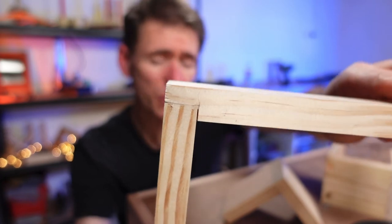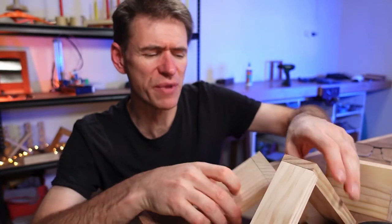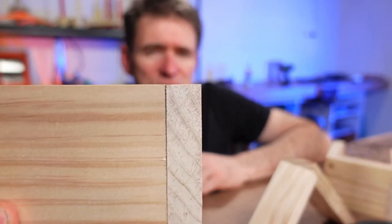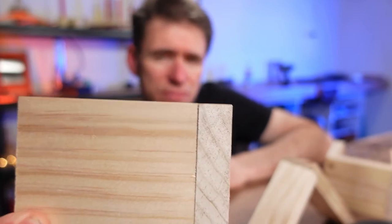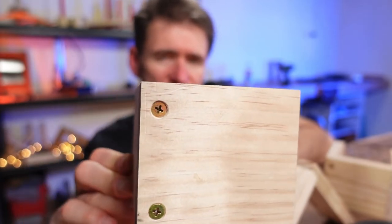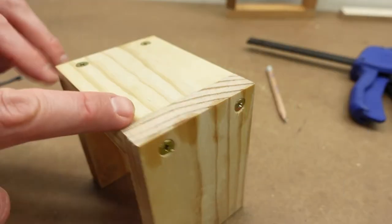And it looks quite good when it's done well, it's very simple. What if you wanted to take it one level further and make it even simpler than that? Could you just take one piece of timber and shove it up against another one, butt it up against another piece of timber and then glue it together? Well, yes you could. And then to make it stronger you would reinforce that with a couple of screws, and you'd end up with the glued and screwed butt joint.